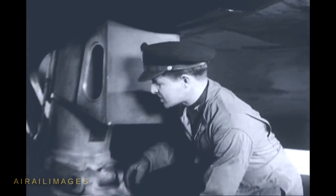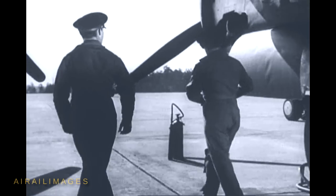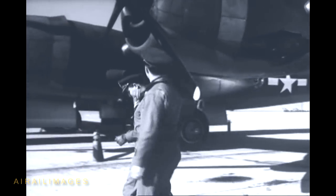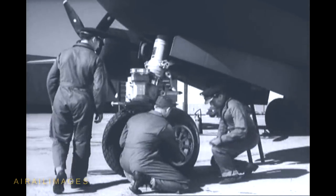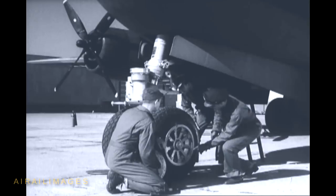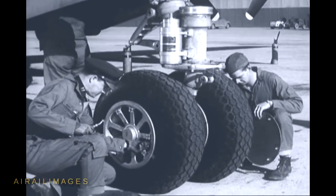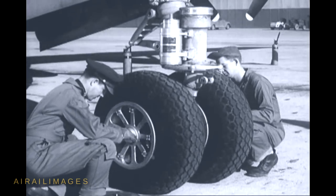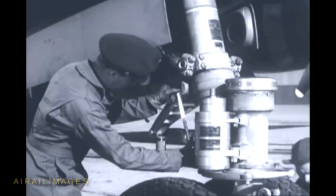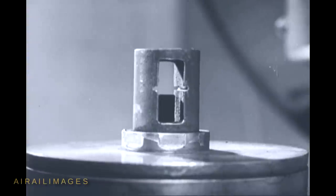Here's a B-29 pilot. He's measuring the distance between pin centers on the left landing gear. This part of the job isn't so glamorous. But it's the pilot's responsibility to make sure that everything on this biggest bomber in the world works properly. Check the nose wheel. See that the tires are inflated to 45 to 50 pounds per square inch. Look over the tires for general condition — watch out especially for cuts or signs of serious wear. After measuring pressure in both tires, give the gear a visual check. The strut should be clean, with a clearance between pin centers of 10 inches. The shimmy damper must be full — make sure the rod is almost up to the notch in the gauge on the shimmy damper reservoir.